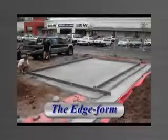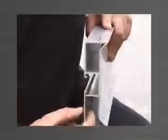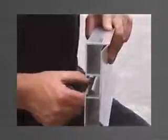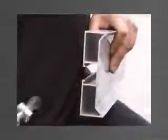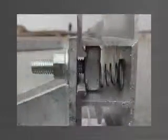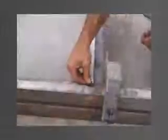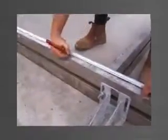The edge form is an extruded aluminium section used to form up the perimeter edge of the panel. Panelware uses a structural grade alloy and a 3mm wall thickness, ensuring the edge forms are strong and durable and will not bow when in use. Designed with the edge form is a continuous track opening to the back. This track accommodates a 12mm stud bolt, which is inserted sideways and turned clockwise to be engaged and locked into position. The stud bolt is removed by rotating a quarter turn anti-clockwise. The edge form includes top and bottom 45-degree edge fillets and a continuous groove, which depicts the actual face edge of the edge form. This allows you to measure from this groove when measuring panel size and cast-in locations such as ferrules and lifters, without having to offset for the 15mm fillet.